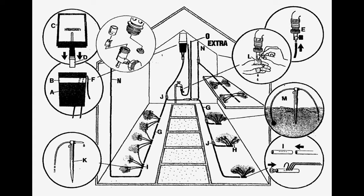Adjusting the valve: to adjust the valve, there's a small cup which has a hole in the bottom. When adjusting, you take off the tube, put the cup underneath, and wherever along these lines the water stabilizes, that level indicates the amount of water per day. So if it stabilizes at the third line from the bottom, it's 30 liters per day, and so forth, between 10 and 100 liters. Once adjusted, keep the cup somewhere safe and put the tube back on.